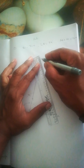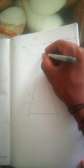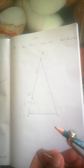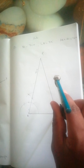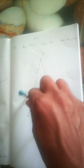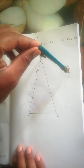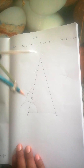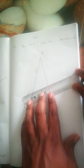This point is P. After that, from C take more than half and cut here on both sides. Keep the same radius, then from P cut it again on both sides. After that we join the two arc intersections.